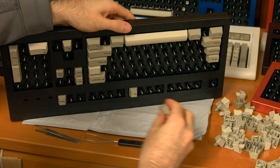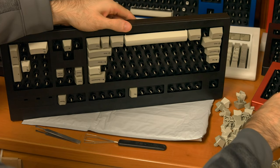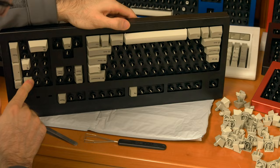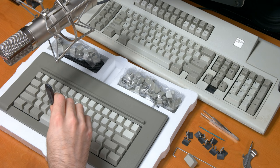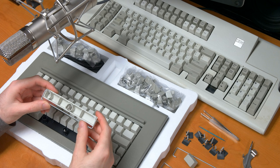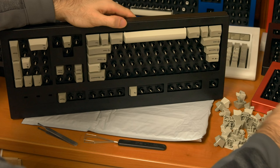Next up we want to remove and reseat any loose or non-working keys. Regarding reseating springs, in nearly all cases you do not need to take apart the keyboard to fix keys that do not click, nor do you need to spend a few minutes pressing a troublesome key. Reattach the key with the keyboard positioned vertically with the spacebar row up. Often reseating a key is not enough to make the key work or to reduce or eliminate a buzzing sound, and you need to remove and reattach the spring. The tools you'll need include a wire key puller and tweezers. To remove your spacebar, the metal spacebar tabs may be pressed down so be careful when pulling off the spacebar and its stabilizer wire. Make sure the stabilizer wire is at a 90 degree bend on both sides to start out with. Slide one end in and carefully press the other side in so as not to break the plastic tab — the wire should rotate freely.